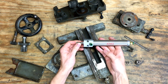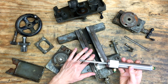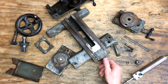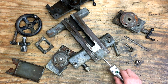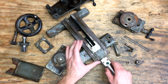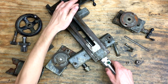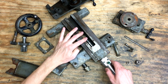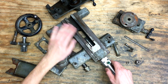The plan is to use a small pneumatic air cylinder to run the cross slide instead of the lead screw that was currently in here. So I think what we'll do is take out this piece, make a different adapter that will mount to the cylinder and thread in here, and this will be able to vary. We'll extend this out past the back — it'll ride on a profile of whatever you're trying to trace, whatever profile you're trying to copy — and then this will attach somewhere here to the cross slide to drive the tool on that profile.